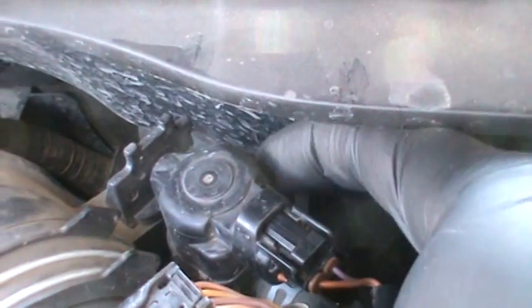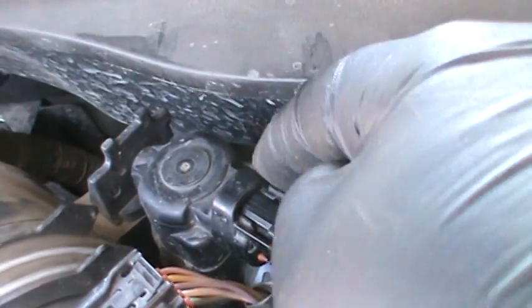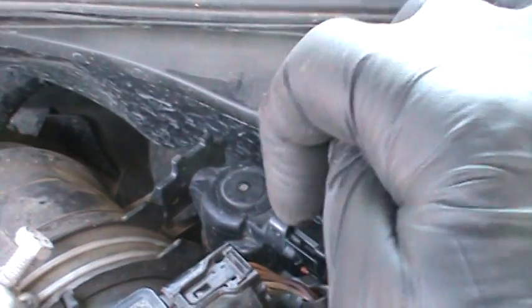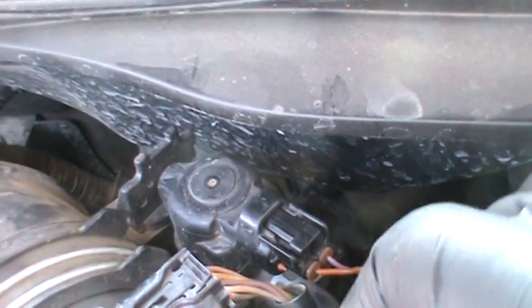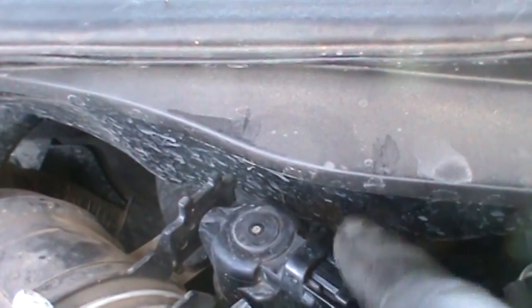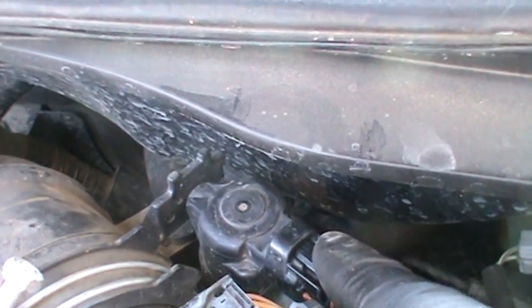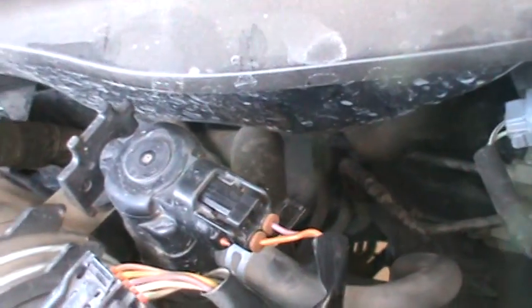So this video is more or less about solenoids and how to check the wiring, and actually how to check this one — the purge solenoid. You would do the same thing basically for the vent solenoid, but keep in mind this purge solenoid is normally closed — it does not allow the flow of air. The vent solenoid is normally open, so it would be the opposite: it would allow air to flow and then when you would activate it, it would close it. A lot of vehicles — Asian makes, especially the Korean makes — these open and close thousands of times throughout the life of the vehicle so they go bad and cause that leak, and it's hard to find the leak. If you have any questions or comments, leave them down below. Thanks for watching — comment, rate, and subscribe.